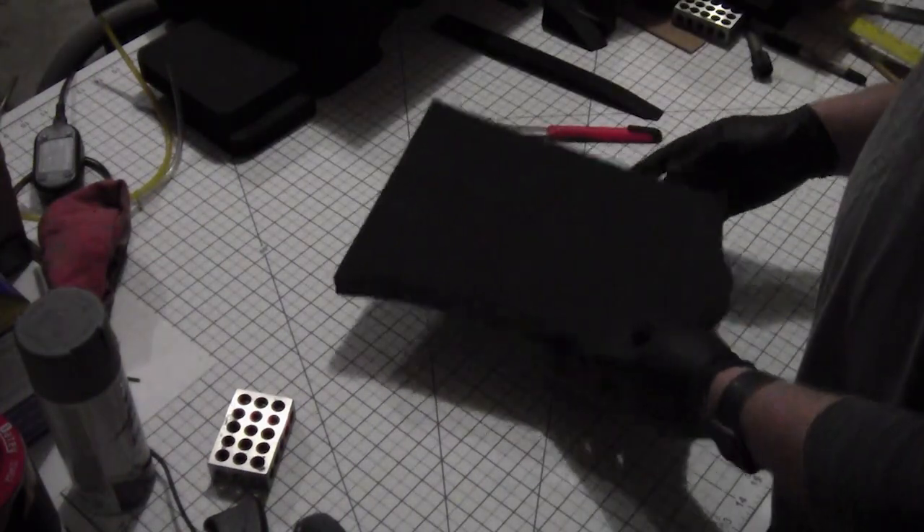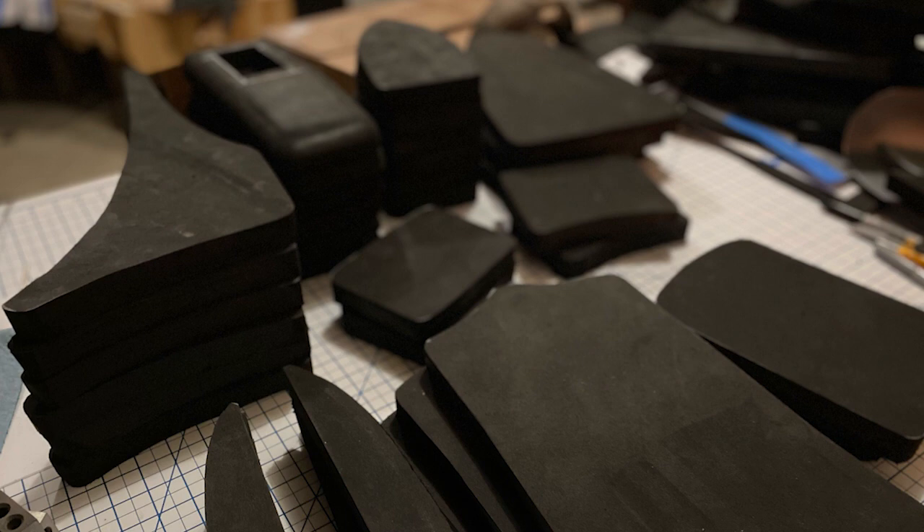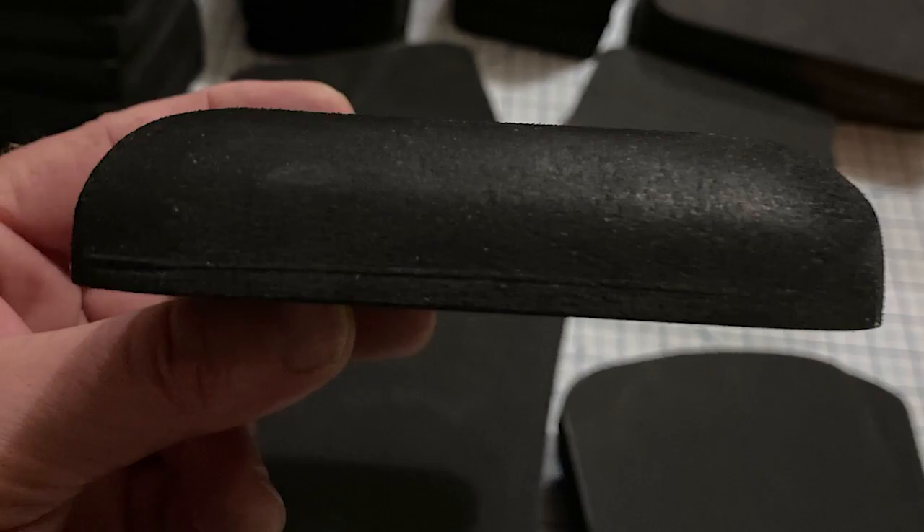For the back of my bench alone, I had 38 pads, all of which I rounded over with my router, sanded by hand, sealed with my heat gun, and sanded some more. I used a combination of techniques from both James Cully and Bryan Thompson, and I'll leave a link below to both of their videos so that you can check out their builds. Thanks again guys, I really appreciate your help with this build.